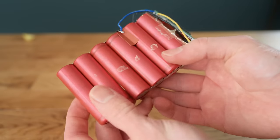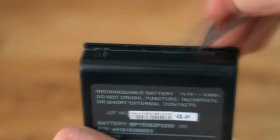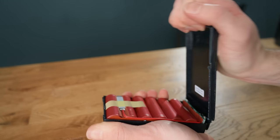So now it's time to talk about batteries. Now most older laptops actually have a battery pack that's made up of, internally, individual 18650 battery cells, which is great news for us because these are really easy to repurpose and put to other uses. However, the challenge is actually getting them out of the plastic enclosure, as it's completely sealed closed, and there's no screws or anything that you can just undo and pop it open. So it just involves breaking the plastic and prying it apart. Now you do run the risk of puncturing the battery cells and also causing short circuits, so only do this if you know exactly what you're doing, and as with everything, it's of course at your own risk.